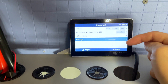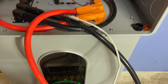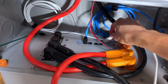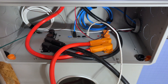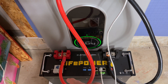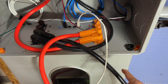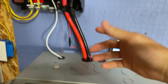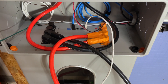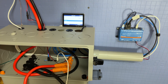The communications work, though it's not perfect — the charge parameters aren't showing up correctly. We'll open an EG4 support ticket and hope they fix that in a firmware update. I'll reconnect the cable now. One advantage of this indoor wall mount battery is that its bus bars are built in, so even if you turn it off the inverter stays on. You also don't need to buy a separate bus bar system.